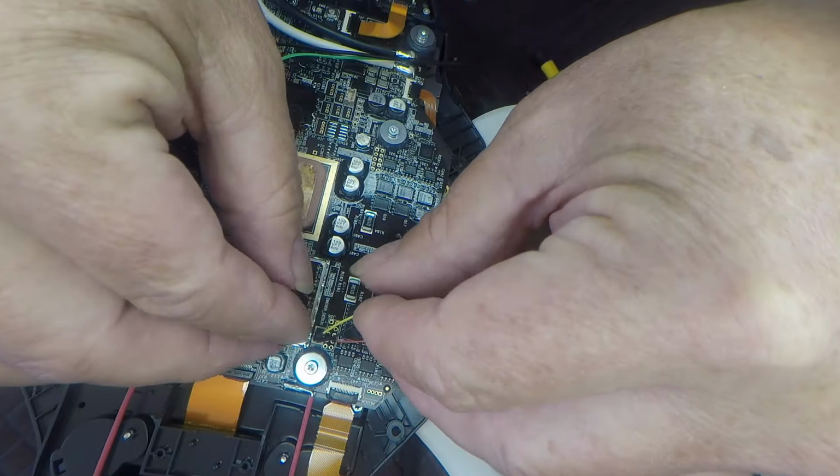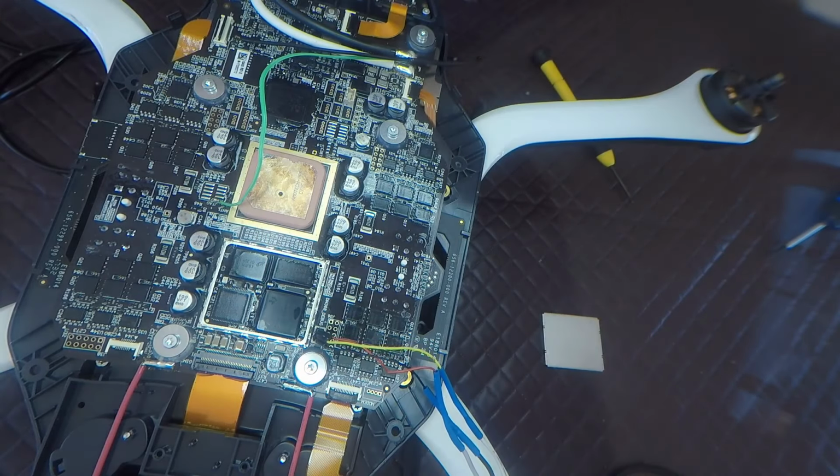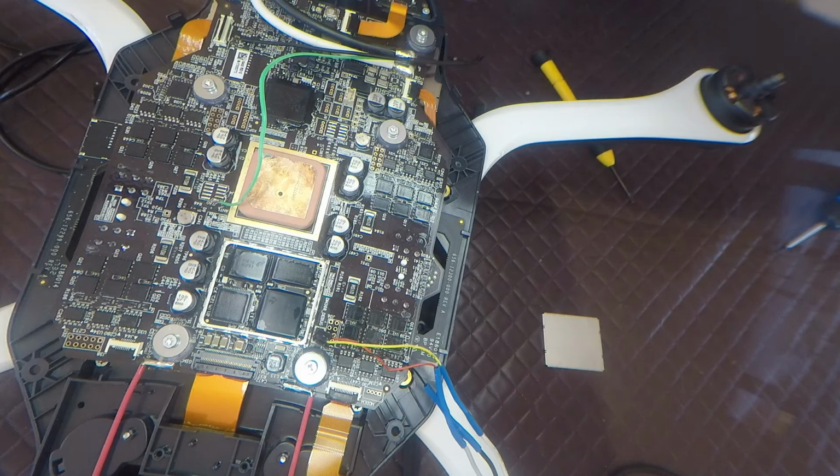There we go. Yeah, cool. There is a little sheet which tells you which way around the other two wires go, but they're not as critical. If you get the ground in the wrong place, you'll destroy your board. So you need to make sure the ground's in the right place. If you get TX and RX backwards, all that happens is you don't get any output on the screen.